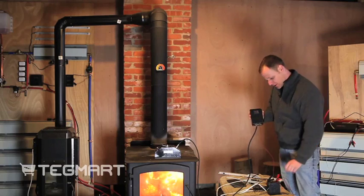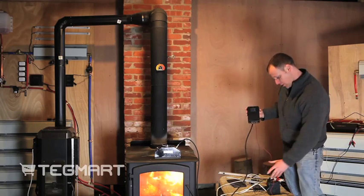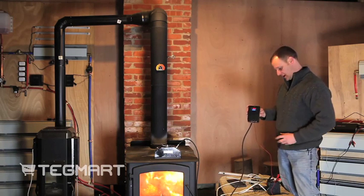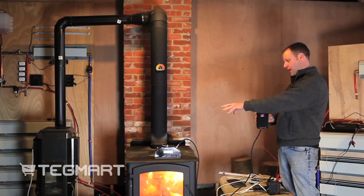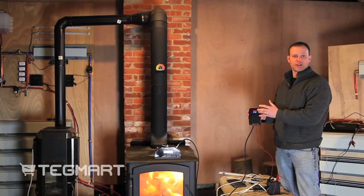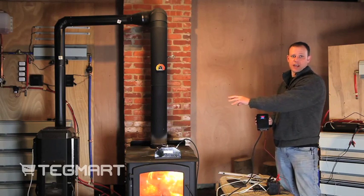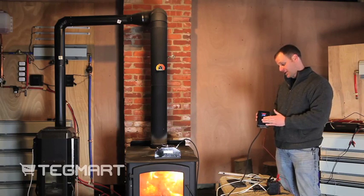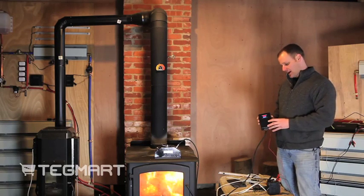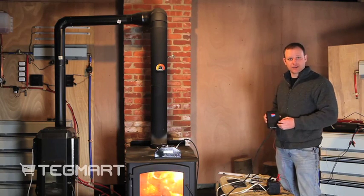What I have here is a diversion circuit hooked up to a battery, so it's charging a battery. You plug this cable right into the generator and then hook it up to your battery. What you'll see is this thing is flashing on and off — whenever it's flashing on, it's sending charge to your battery. When it's off, it's allowing the thermoelectric generator to recharge itself and get its power built back up. If your stove is hot enough it's going to stay in a constant on mode, or if you have one of our bigger generators. With this battery, you could basically have it charging during the day while you're out, and then at night switch off and have your lighting system running off the same generator — it's a power supply that has multi-purposes to it.